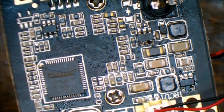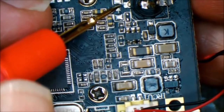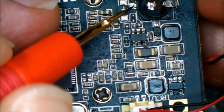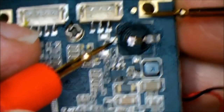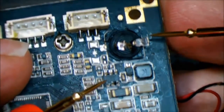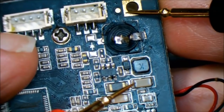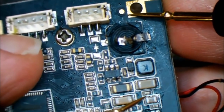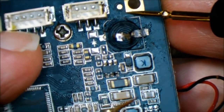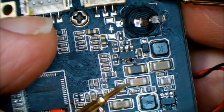Any shorts to ground perhaps? Which one's negative? We'll go with the exposed copper there, and we've got three million ohms across the capacitor. Then if we check across the output — across one of these — we're looking at a few thousand ohms there as well. It's definitely ground side. That's 20k, that one's ground, and that one's...